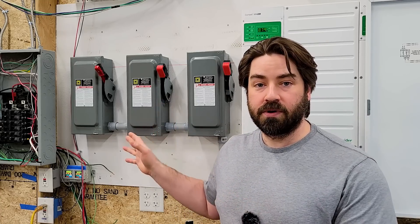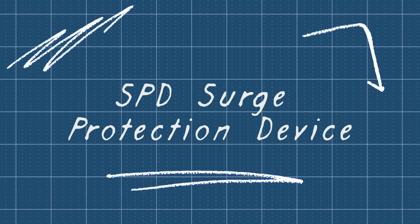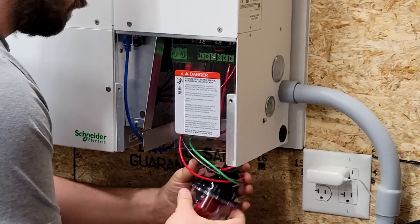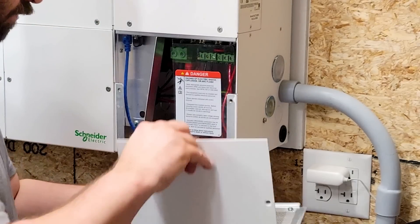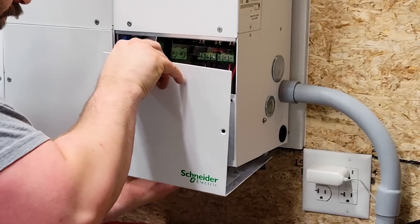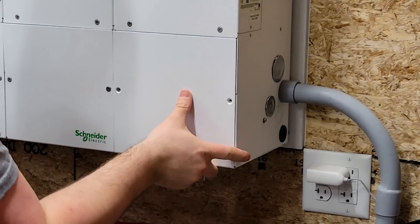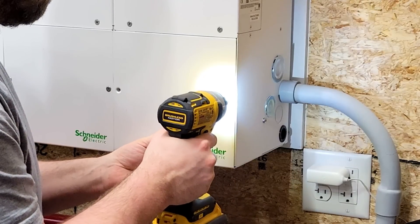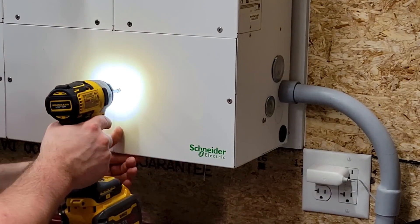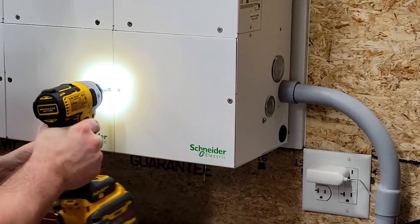The three disconnects are running up with conduit so all the PV wires from outside come into the three disconnects, then go down through the wireway and over to the three charge controllers. The final step was adding a surge protection device (SPD). I couldn't find one made by Schneider rated for 600 volts DC, so I purchased some from Midnight Solar — a good quality UL-listed brand I've used before. I wired them into the same terminal block that the PV wires go into, since there are three spots for positive and three for negative and I'm only using one spot for the PV array. The cover has vents on the bottom with a screen, allowing air to enter, and there are fans at the top of the charge controller to keep it cool.